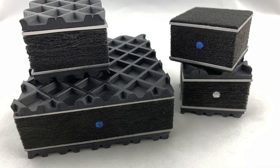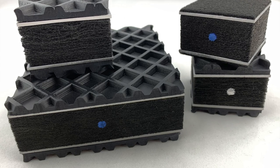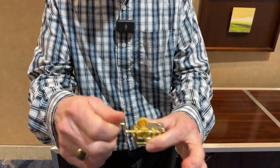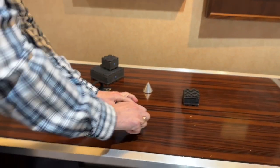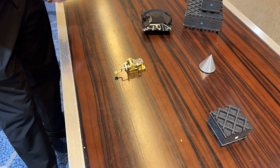Most of you are probably familiar with the equipment vibration protectors, which is what we're showing here. For those of you who are not familiar, I'll give you a quick demonstration — it's done with a music box. This little music box mechanism in the air has poor impedance match, so it's very hard to hear. Those tines are moving plus or minus 0.1 millimeter and going down to about 500 hertz. But if I couple them to anything — that's about a 27 dB increase. Now this whole tabletop is only moving a few billionths of a meter, but it is amplifying those frequencies by about 27 to 30 dB.